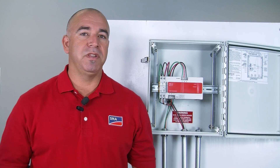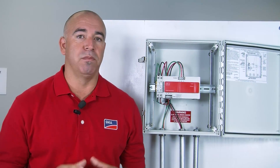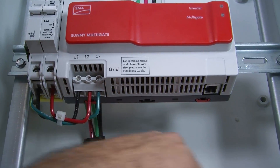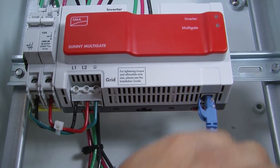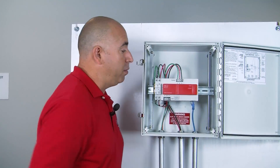We showed you exactly where the AC connections for the Multigate US are. Now we're going to show you where to connect the Ethernet cable to the Multigate US. Unlike traditional microinverter power line communications, SMA's solution provides a more reliable communication solution by sending the information through the Multigate US directly to the customer's router. A major benefit is that you don't have to add costly filters to your system. With communications in place, we can replace the cover plate and begin commissioning.